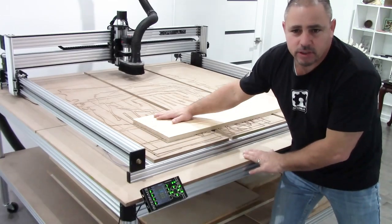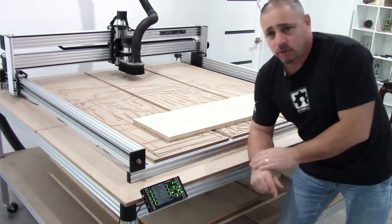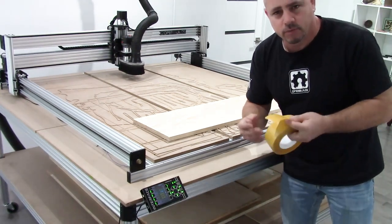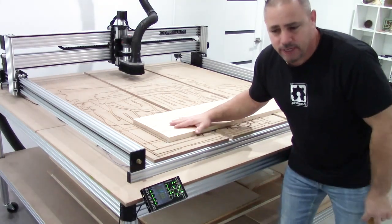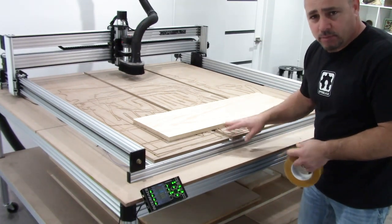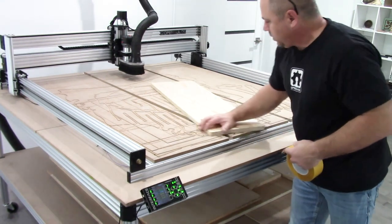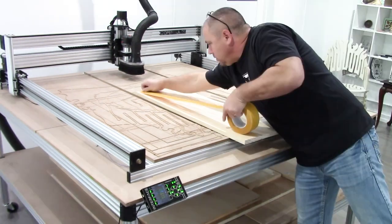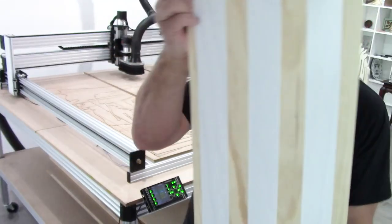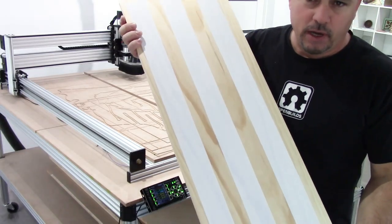This board is 11 inches by 35 inches roughly, so we have plenty of room to work. I'm also going to be using double-sided woodworker's tape. If you guys haven't used this before, it's really nice. When you have a cut that's not super intense with a lot of torsional forces on it, this works really well, and this way we don't have to set up clamps or hold downs. After you're done cutting, the only real way to get it off is to roll it off — it doesn't leave any residue behind.